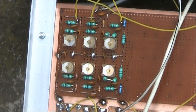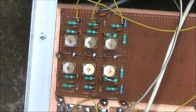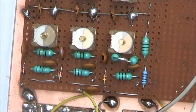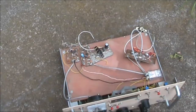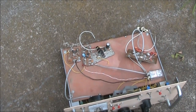Here is the bandpass filter board that caused so much trouble before. There are three filters: one for 1.8 MHz, another for 3.5 MHz, and the other for 7 MHz. They use RF chokes as the coils — no winding required. There is not much on the top; that's reserved mainly for the transmit section and the low pass filters.